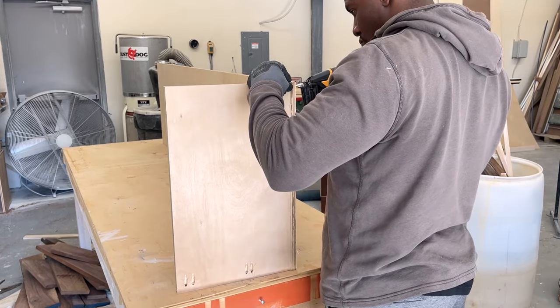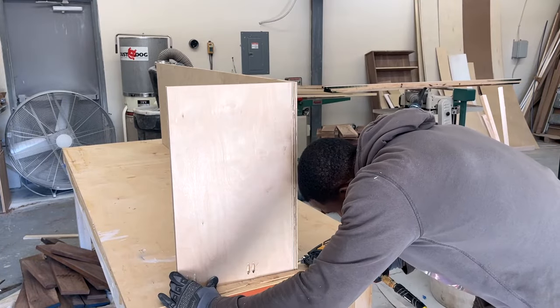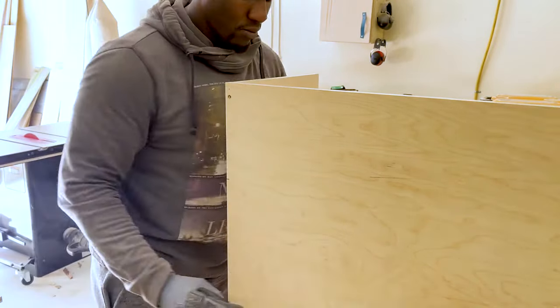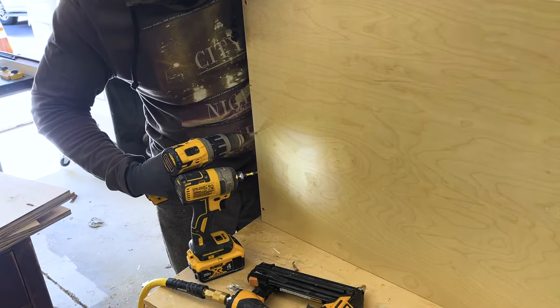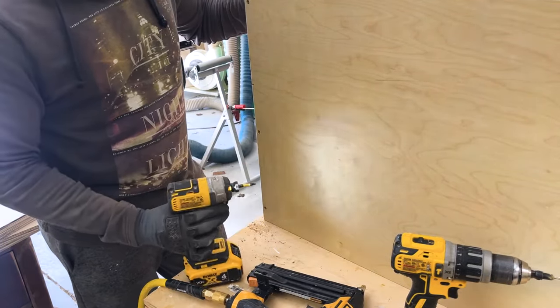If you've never seen this before, this is something I like to do: I brad nail the two pieces I'm screwing together, pre-drill a hole, and then screw the two pieces together. This acts like a second set of hands if no one is there to help you. It works very well on all of the projects we put together. The only issue is if you have to take it apart, but that's not too difficult.